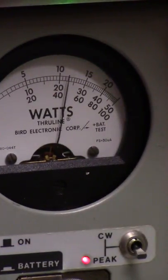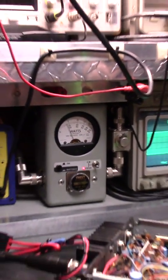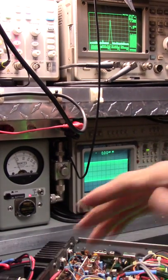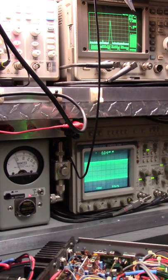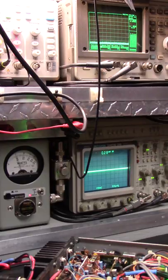Alright. Pretty darn close, huh? And that's where I'd really run this thing. Sideband's doing really decent. This is basically a sideband radio. The Allens, the Emperors, the Jackson, all the ones that were low level modulated that basically sported an MRF-477 and a sidebander were low level modulated due to the fact that they're clean in linearity.